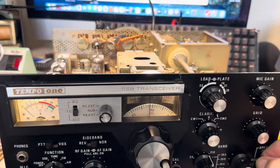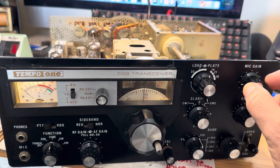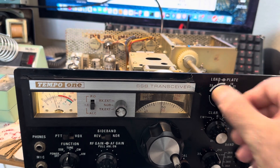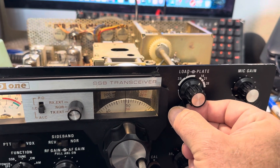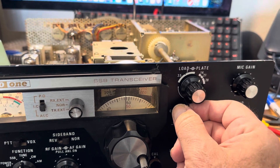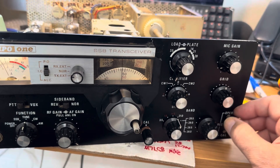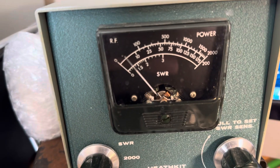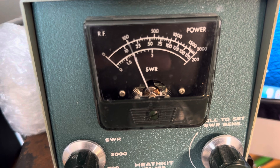Let's go to 15 — that's been my trouble band, but it's working pretty well now. Go for a grid — whoa, a lot of drive on 15, lots of drive. Go for a dip there. 15 likes to have a bit of load, so I put load about here and 15 is pretty happy. It takes a real general adjustment to get it just right for 15 to have power. Let's peak the grid again — what kind of power are we getting? Not much.